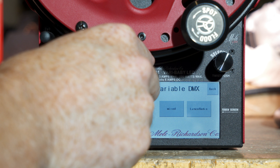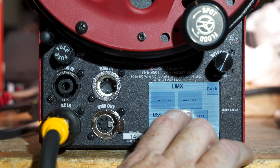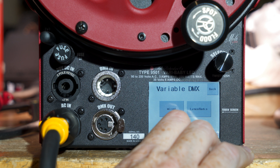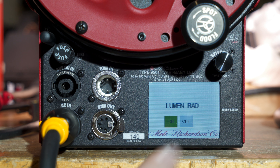I'm going to remove the DMX and then we have to hit link — and it's already linked. This is Lumen Radio, so it must say linked. You can unlink it — it says unlinked — and then hit link so it's linked. We'll go variable and I hit Lumen Radio because that's wireless. This must be on. On means you must be linked and on so that it transmits to the receiver on the board — the Lumen Radio receiver — so that you can go ahead and control it wirelessly.